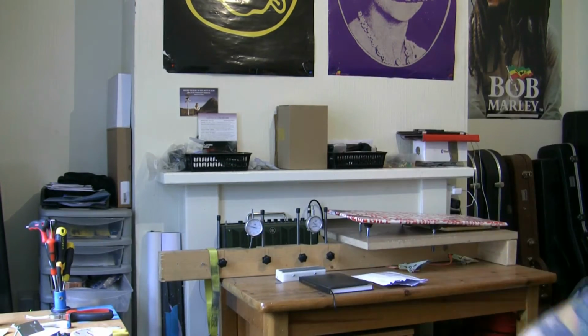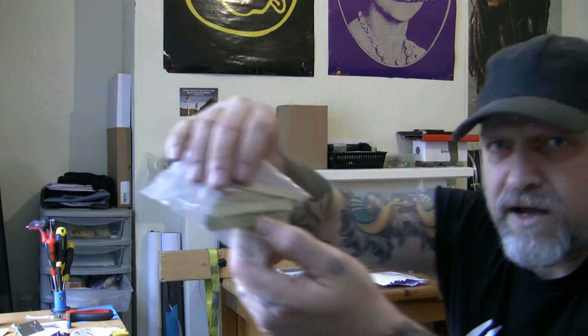Regarding once the frets are more or less in, I will take a 12-inch radius caul. The little brass thingamabobs there. Have I got any out? No, there aren't any out, so if I can just grab them quick. Here they are. There you go. They are your cauls. I will take the 12 and I will place it over the fret once I've hit it in, and I'll just tap it across just to make sure it's all seated nice, minding my fingers as I do so.